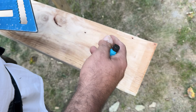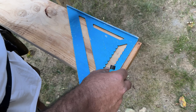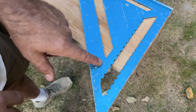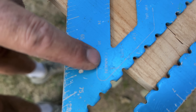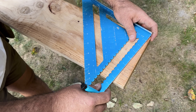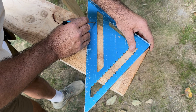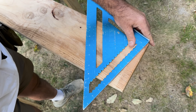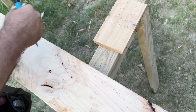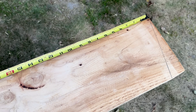The first thing I need to do is lay out my plumb cut at the top of the ridge. For that, you just need a simple speed square — in this case a 12-inch square. Line it up at the edge. You'll notice a label called 'common' — we're dealing with a common rafter. All those numbers on there signify the pitch, and we're dealing with a 3-pitch. You have your pivot point, line up the top of your rafter with the 3 because it's a 3-pitch, and that's your plumb cut. My run is 10 foot 2 and 5/16ths.